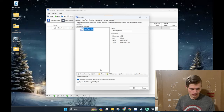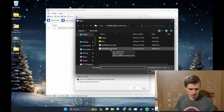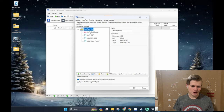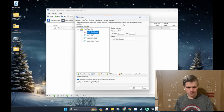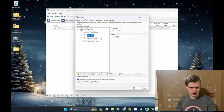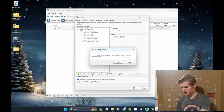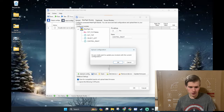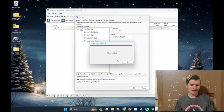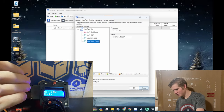I uploaded the firmware and now we have this MobiFlight Uno. So now we select it, go open, click this MobiFlight Uno or Mega. Now we have all of the settings preloaded. We have our display with two lines and 16 columns, our top button two, left button three, and our control button four — just like we wired up. We're going to click upload config, click okay, and now we have our LCD thing.